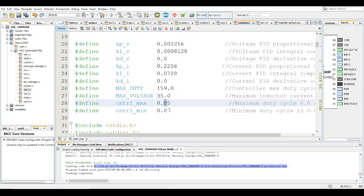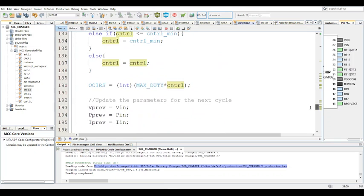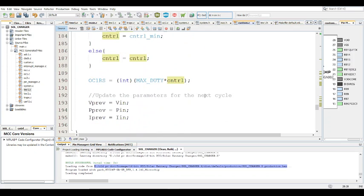And it's obviously more complicated if you're using a Cuk converter to get to the maximum power point. In that case, your algorithm has to be really solid, because with the Cuk you could have the output higher or lower than the input, which is interesting, but makes coding an MPPT charge controller with it quite interesting. All right, so that's that basically for the perturb and observe.